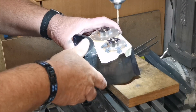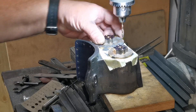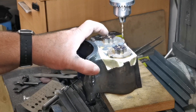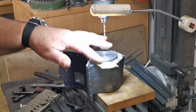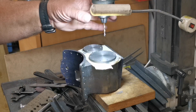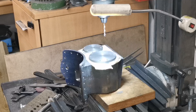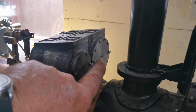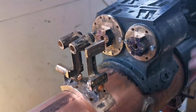That's the high-pressure holes drilled, ready for tapping. That's all the holes drilled on this side ready for tapping. I'll knock those off, turn it over, and do the other caps, and then I'll be able to tap all of those holes. With those holes drilled, what I'll do next on these plates is drill these holes out for a clearance hole so they'll slide onto the studs that go into the tapped holes in the cylinder block.